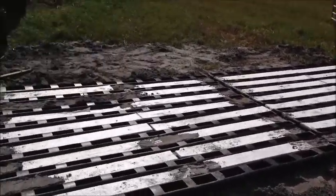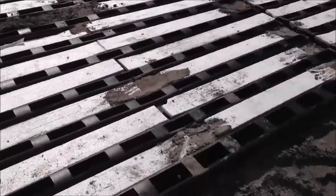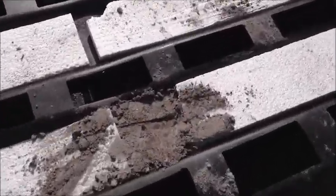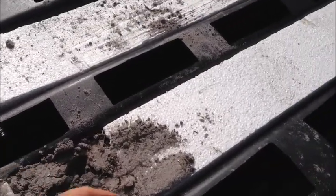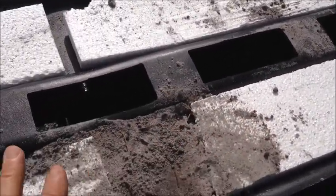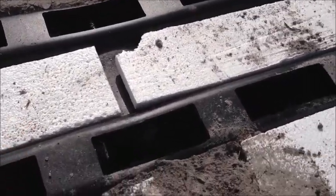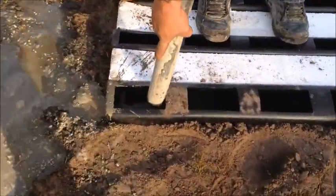You can see they added a little dirt around the edges and lightly tamped it. Any place where the foam was broken, you simply put a little bit of dirt in there, because all that's going to get taken out anyway after the pour. Concrete is going to go in here around all this rebar.